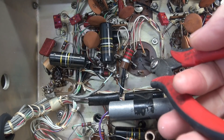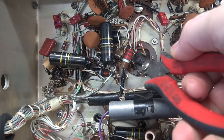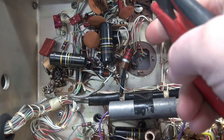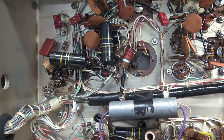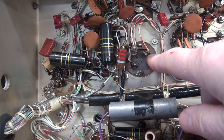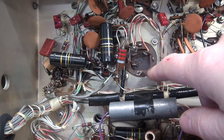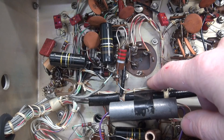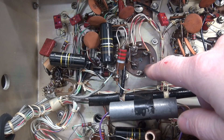How I like to do this is I come in here with a pair of wire cutters and clip the terminals off the cap. I'm not going to save this filter cap, and this leaves me a road map for putting in the new one. The cap is cut loose — you can see all the wires sitting in the area they were originally connected. Now I need to pull out this cap. You see this phenolic material? That's an insulator from the negative side of the cap to ground — this cap is not connected direct to chassis. When you pull this out, you've got to be really careful, because if you break this, you're hosed.